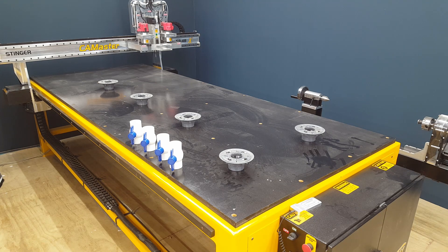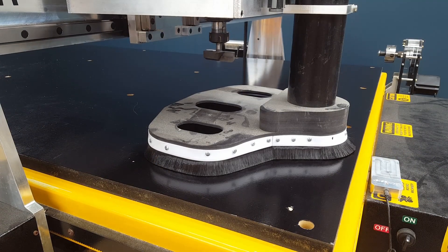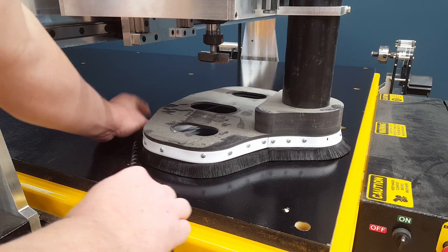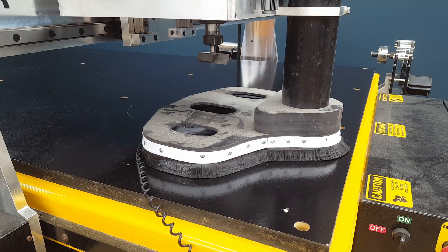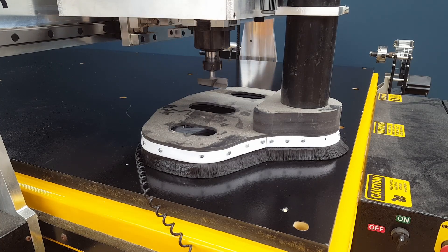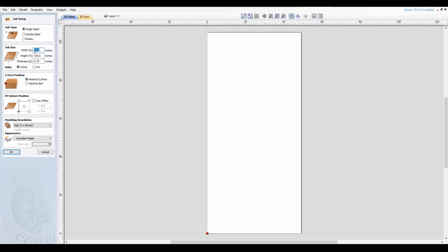Here I have a two-and-a-quarter-inch end mill that I'll be using to surface the tabletop. I want to make sure everything's flat to start, so I'm going to shave about a sixteenth of an inch off. I'm measuring for the tool so the machine knows where it is, and then touching the top so it knows where the top of the table is.